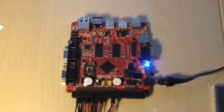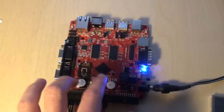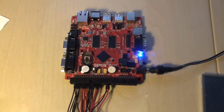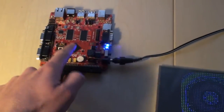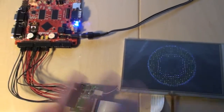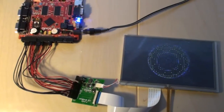The great thing about this board is that it contains the LPC4088 microprocessor from NXP. It's a 120 MHz processor, and the board features SDRAM connected to the microprocessor, as it supports SDRAM to be directly connected to the memory bus. It also features a built-in LCD controller, so you can use this RAM as a frame buffer.